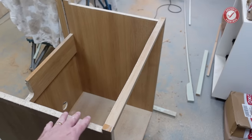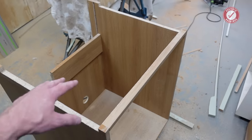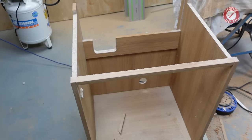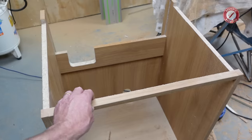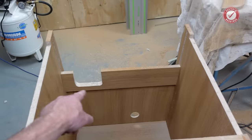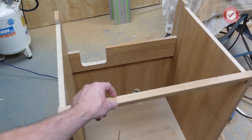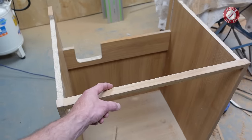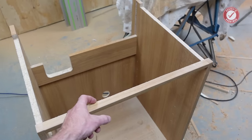I've also had to cut away the front edge of this unit, so there's very little holding it together right now. We need to be careful until we get the support fitted, because the support for the sink will add quite a lot of structural strength to the unit. At the moment, there's only a tiny bit held in with a single dowel and a little back piece stopping the whole unit from falling apart. I've left 25mm at the front — there'll be a 20mm worktop overhang, so this allows for a minimum of a 40mm strip at the front.